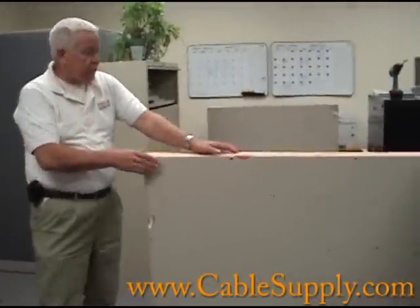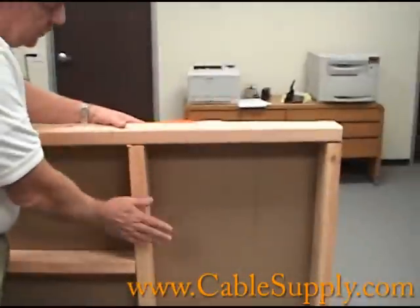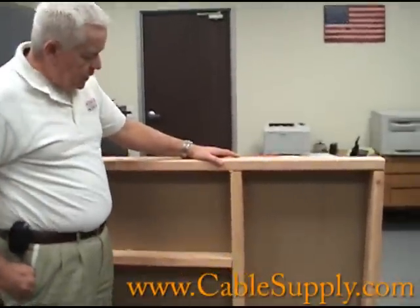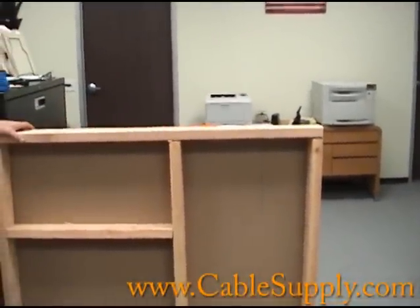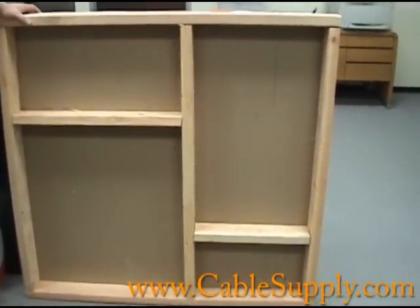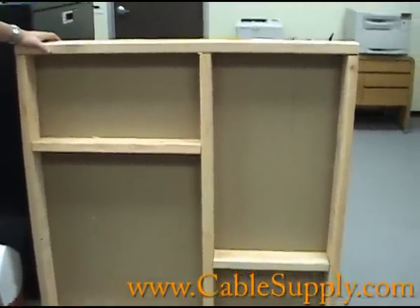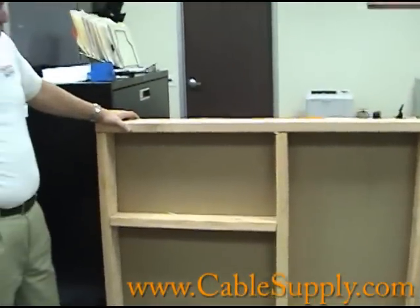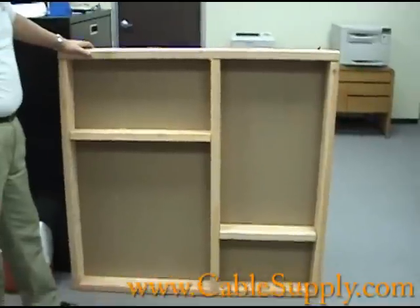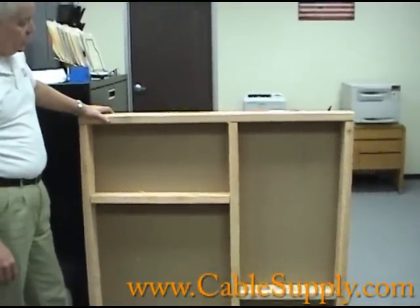Come on over here and take a look at this. It's wood construction — it usually has plywood on both sides, and of course the wall isn't this high; it's normally 8 or 10 feet high. What you'll find in drywall made out of wood is that they have things called fire breaks. A lot of times people don't understand that cabling in wood construction is a lot more difficult than cabling in metal construction, where you don't have fire breaks in the metal I-beams — fire breaks are only found in wooden 2x4 construction.